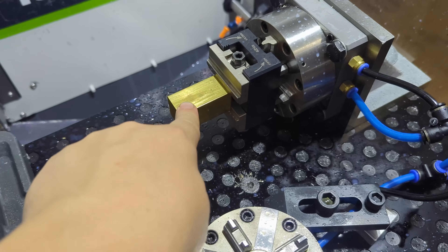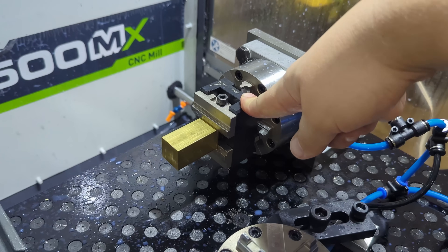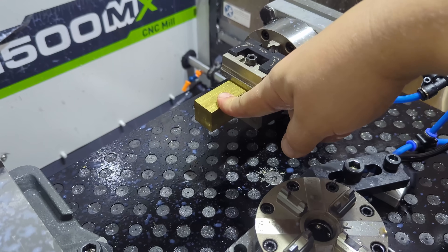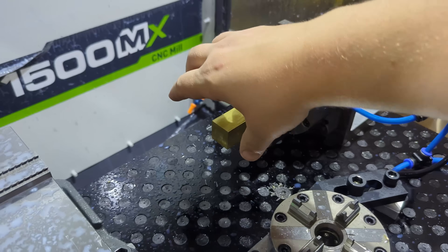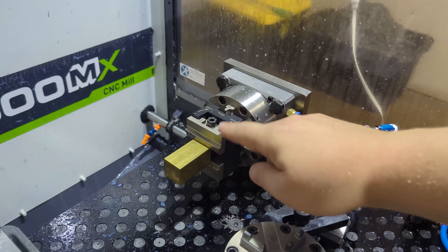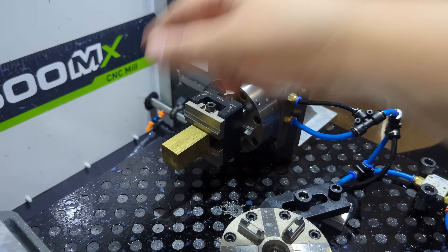All of our tools are loaded up and now we need to touch off our work coordinate system. In a perfect world I would have a gauging palette that I could put on here, but I don't have one of those so I'm going to need to get a little bit creative. My goal for this work coordinate system is for it to be in the center of rotation on this thing, so as I turn it around I don't have to re-probe every individual side — kind of like a lathe where the center of rotation is your x-axis. That's what I'm going here except it'll be my Z and my Y, and only my X-axis will change because I'll keep that on the end of the work piece.